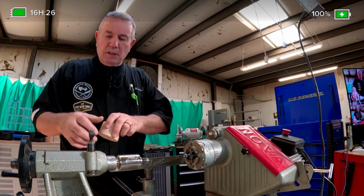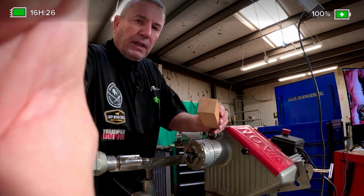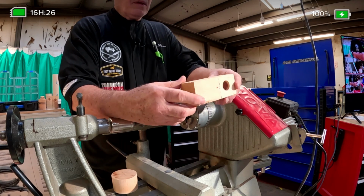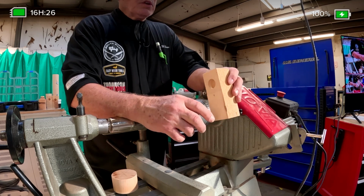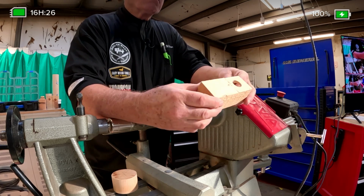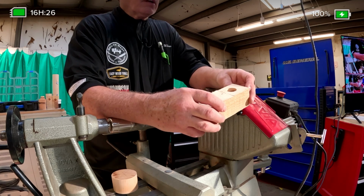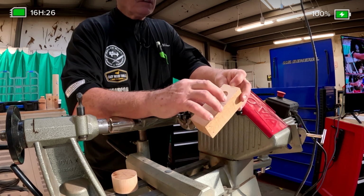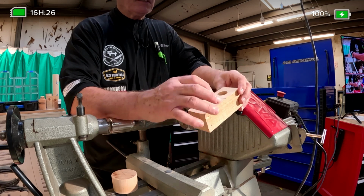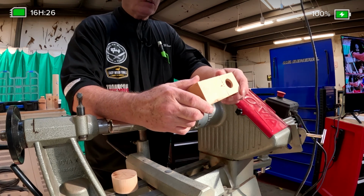What we're going to do first is a hummingbird house. This hummingbird house is a 2x2 piece of wood, squared, and 5 inches long. We'll use a 1.5 inch Forstner bit and take it down just a little below 2.5 inches, below the perch hole. The entry hole is 1.5 inches to the middle, and we'll use a 1 inch Forstner bit. Then we'll go another inch, for a total of 2.5 inches in the middle, and use a 1/8 inch drill bit for our perch.